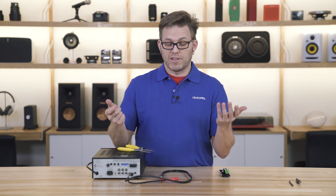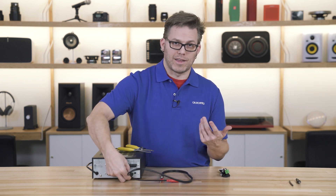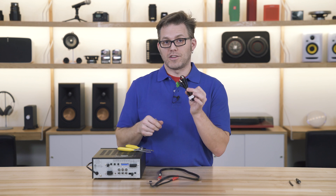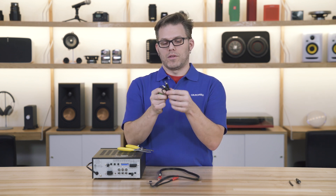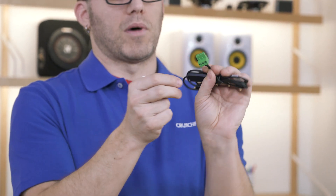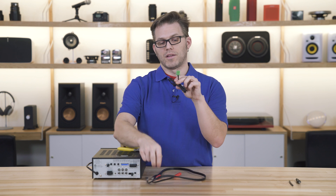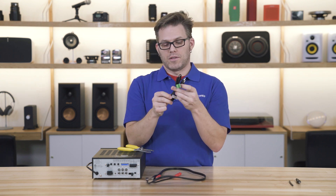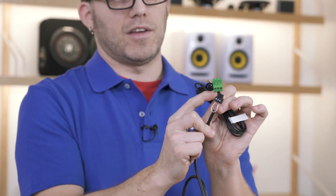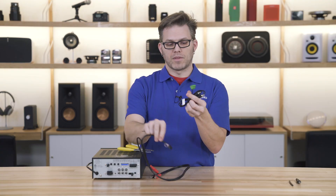Now, in the event that you need to wire in a stereo source into your Phoenix connector, we can't just wire it directly in, at least not for high fidelity audio. What we're going to need to do is get a YSUM cable that is designed for summing stereo RCA down to a mono block. This probably looks pretty familiar now that we've taken a look at this Phoenix connector block — you'll recognize the pins, the outs, the whole thing. However, this block is not the same size, so we're going to need to adapt it by removing this end and wiring it properly into the other Phoenix block.